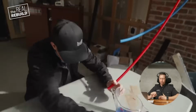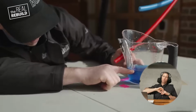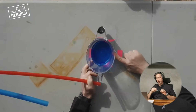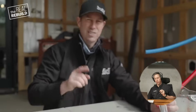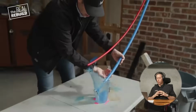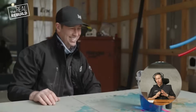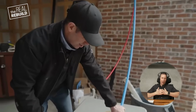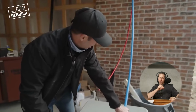So in other words, I did a trunk and branch line at my house where the main trunk through the house is a 3/4 line, but then my branches, or maybe twigs, depending on how you look at it, are all 1/2-inch PEX. To be honest, if it was code approved, I would have gone 3/8 PEX at almost every location. With today's low flow fixtures, you don't necessarily need 1/2-inch, even on showers and other higher volume devices, to get that amount of flow through them.